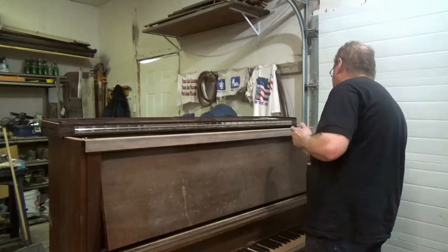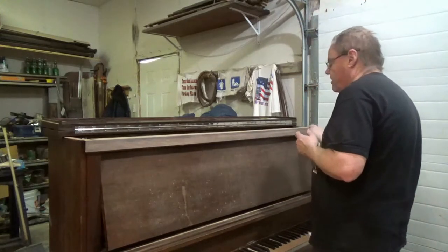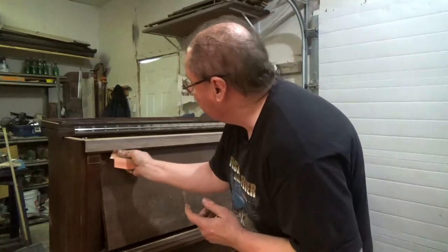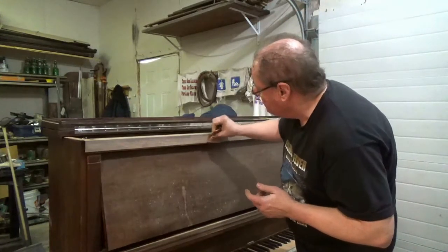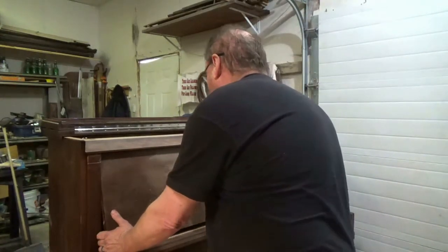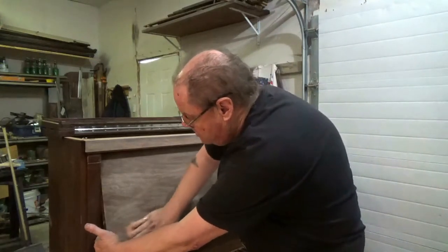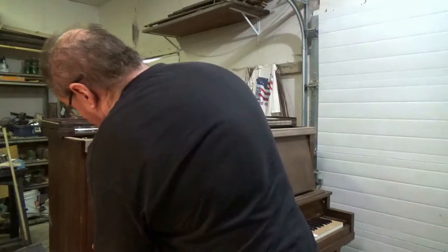Or we may make it totally re-amalgamate the dust back into the finish, filling the pores. So it's not really bad to leave it dusty. Most of the things can be done right in situ — right in the place where it is — because it's firmly in place. Just be a little critical and make sure that everything is even. This particular frame has some damage on it, so I'll just sand this lightly.